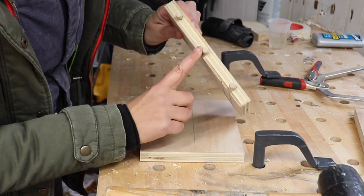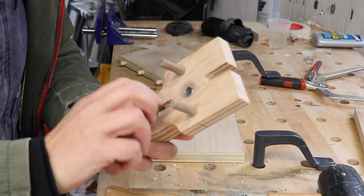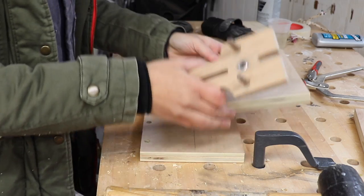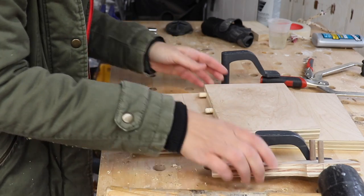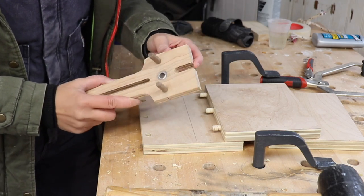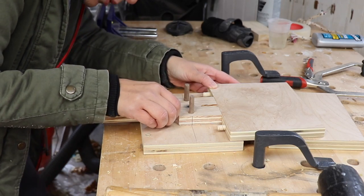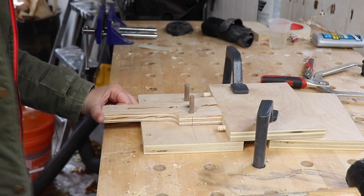The process starts out the same — you would first drill on the edge of the first board, and then to use this jig, you'd have to remove the fence piece. This is where those center lines that I drew out come into play. I need a support piece because these pieces are too short. So I'm going to put this dowel from the first board into the notch again from the jig, and push it until both of my center lines are on my line where I want to attach this board. Now I'm going to clamp this board down and drill away.